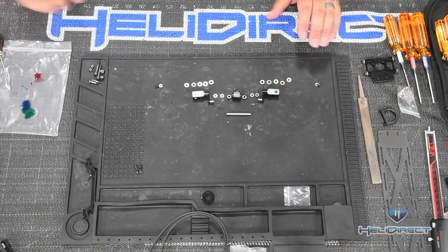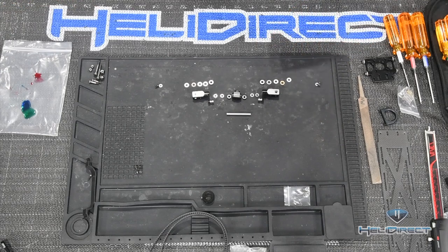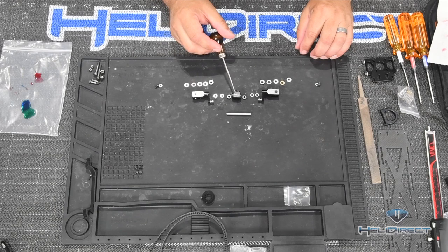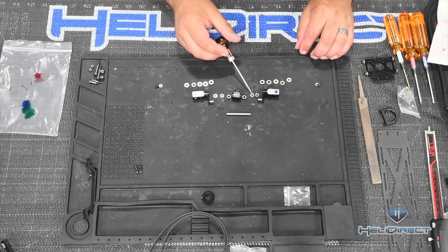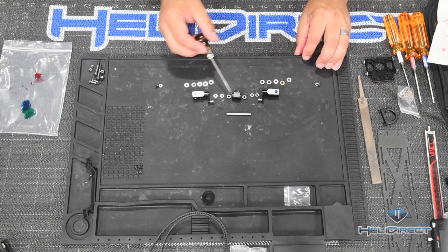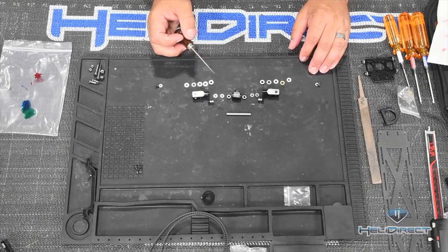Okay, so now you can see that my layout here looks a lot like the manual, and I'll walk you through it. So this is our feathering shaft that'll run through our center hub. And then we've got these two little hard plastic palm-type dampeners here. And then we have the washer that we're definitely going to use, and then a thinner optional shim in here. If we have any play in the tail, the shim will take it out, and they just provide these because of, you know, variances in manufacturing. You may or may not need them, but they're not mentioned in the kit at all, so that's one of those things you just kind of have to know.